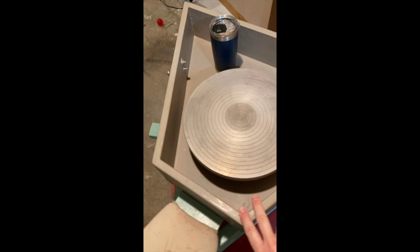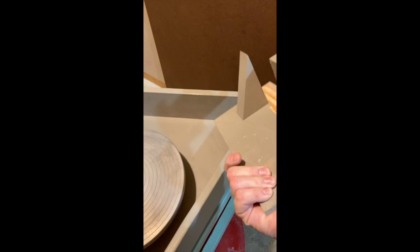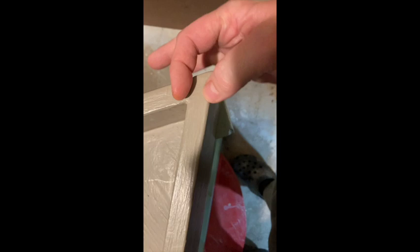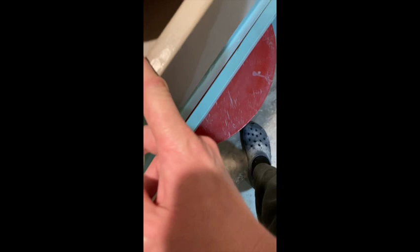We'll start with the box here — this is just pine, like a one-by-six. It's extra wood I had. I made a little shelf that sits right here; I've just screwed these together, no fancy joinery. Maybe the fanciest thing is the angle of the cut. It's not a big deal — it's really not hard. You don't even have to cut these flush; they could just come out a little proud and that's alright. These look like I cut at an angle here — you just have to figure it out with a protractor. Once you start getting into the project, you'll understand how it works out.